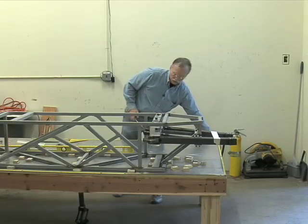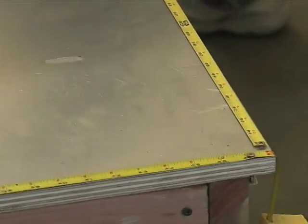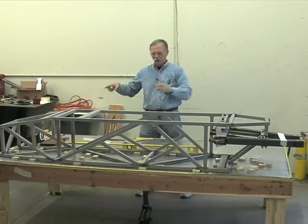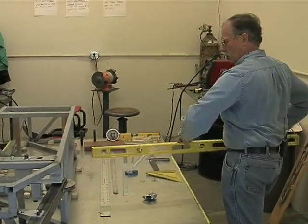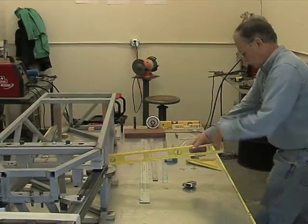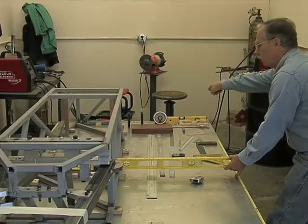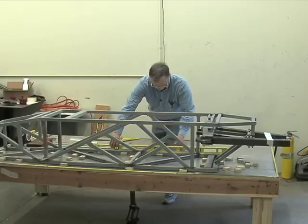These are all made by the same company, so they came off the same assembly line, and we pull two this way, and then we pull two this way. You don't start one on one end and the other on the other end. You always start them on the end. That way, if I wanted to bridge all the way across this table, I can come down to 51 inches on that rule, 51 inches on this rule. I've got a cross line 51 inches from that edge. And I can rely on that because that's going to be fairly accurate.